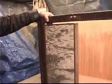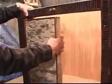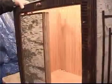This is my project I'm working on now. It is a bathroom vanity. It has nice birch-faced drawers here. I haven't even mounted them yet, but I have about 2 days more work on this, and twigged out in the front with red osier twig work, some acorn accent pieces top and bottom, and a nice design on the sides. This particular vanity will be approximately 31 inches high, about 24 inches wide, and about 20 inches deep.